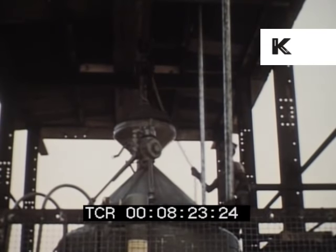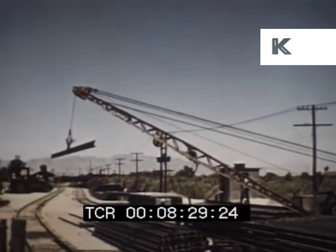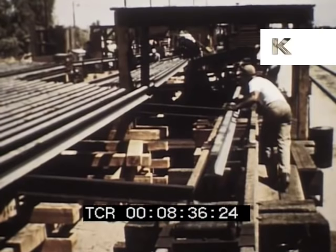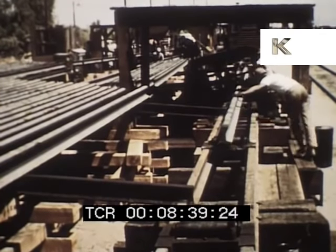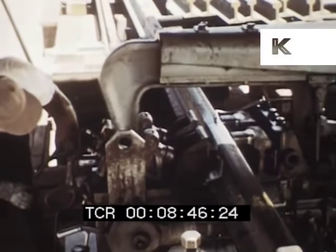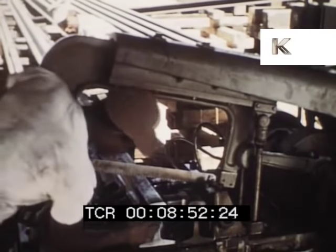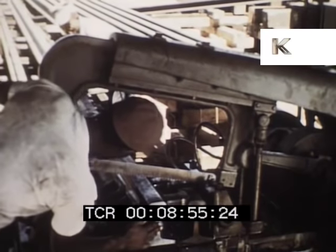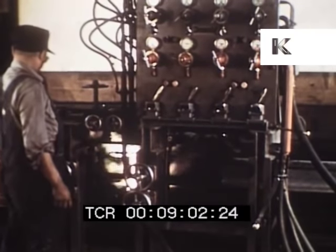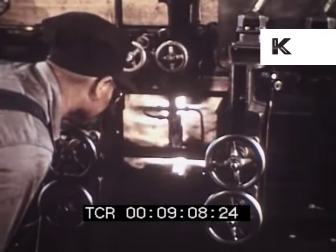Carbide in a movable hopper is taken to each generator in turn. At the beginning of the double assembly line, rail is moved from stockpiles and placed on rail skids at the head of each line. Rail is moved from skid locations by hand and positioned at the saw station where two rail ends are trimmed in one location. Only a small amount of metal is cut away, sufficient to square up the ends and clean them, presenting a bright surface for the welding which follows. In the welding machine, adjoining rail ends at the weld location are heated by oxyacetylene flame.